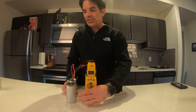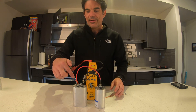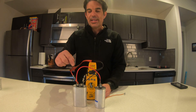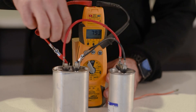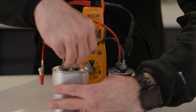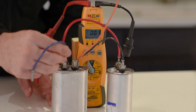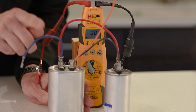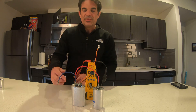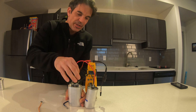You're not going to run into this every day — this is just an emergency-type trick. Where you see I have the terminals on my meter hooked up, those would go to the start winding and your power coming in. If I was going to wire this to a compressor, this would be my line in and this would go to my start winding — blue to the start winding, orange to my line in — and that gives me an 80 MFD capacitor.